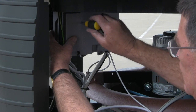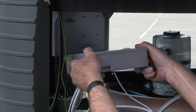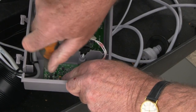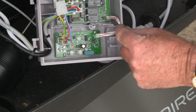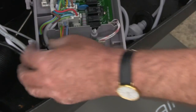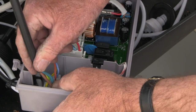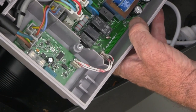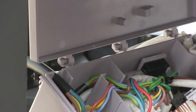To access the control board, loosen the encapsulated screw. Lower the new flip-down door to 90 degrees and slide right to remove. Fit the solar PC board in the left-hand side of the main board and secure with the four 6mm screws supplied. Fit the connecting harness from the solar PC board to the main board. Plug in the inverter harness to the solar board and bring through the harness slot. Reinstall the board as per removal, ensuring the board is at 90 degrees from vertical. Replace the encapsulated screw.